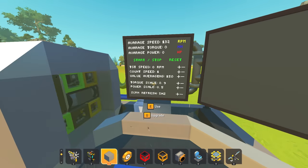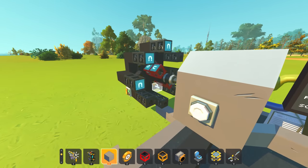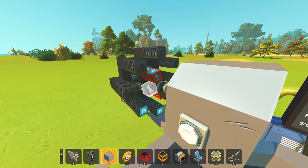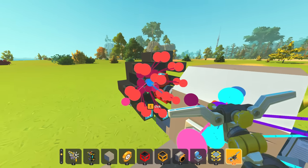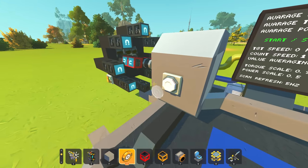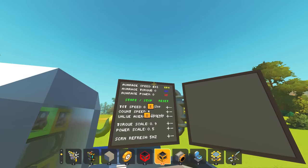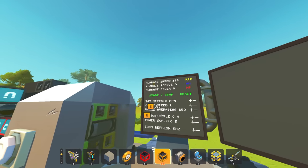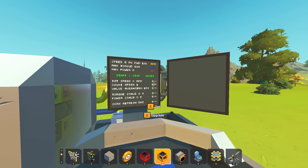133 RPM or so, 132-133. The thing is, I don't think this is going to apply any torque at all. The only torque it can apply is the physical opposition of the magnets - the invisible magnetic force. There's no physical connection; this is just a free-floating bearing on a free-floating motor. Magnet motors, if we could really make them work, they'd be good for speed but terrible for torque. And of course, this one's terrible for both.